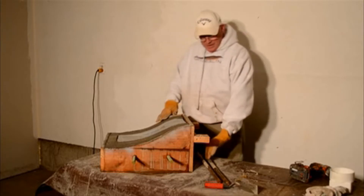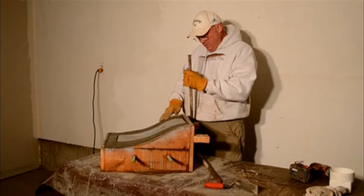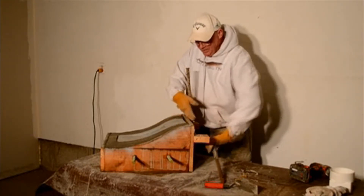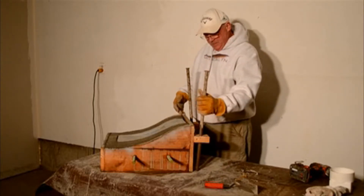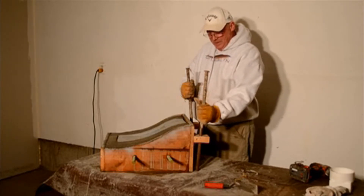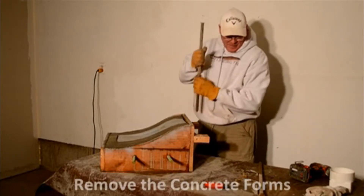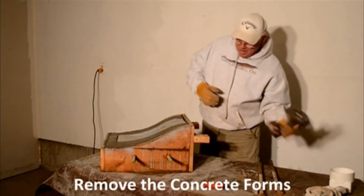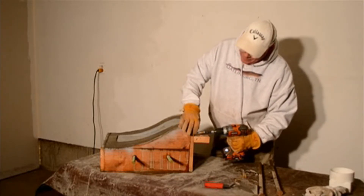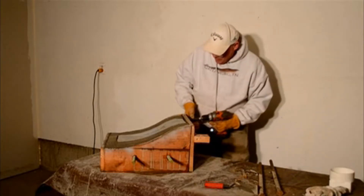I didn't put in the pins yesterday, but before you pour, to put a backing on this existing curb or new curb, you'll need a plate to back it up. Just throw the pins in to support the back of it. When you're done, let it set up and cure, then remove the pins, take off your backing plate.